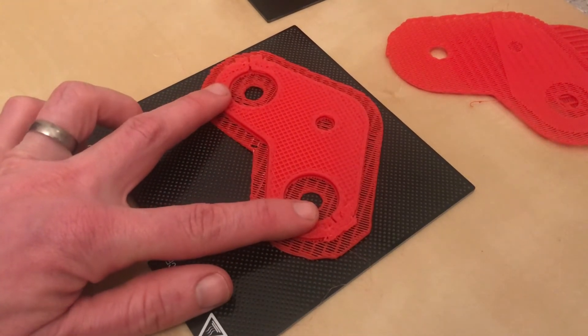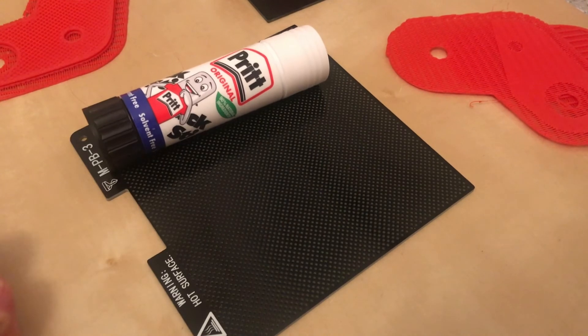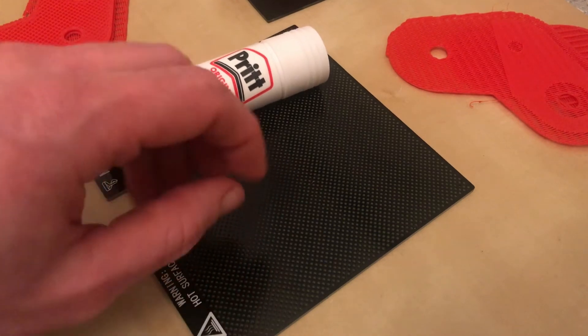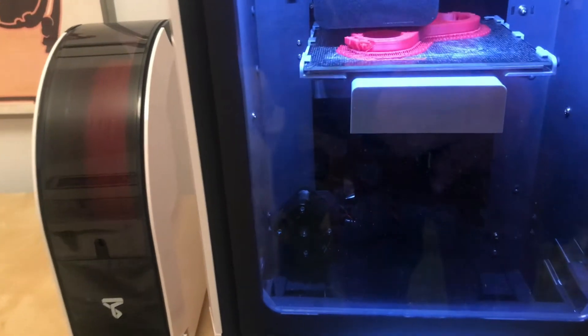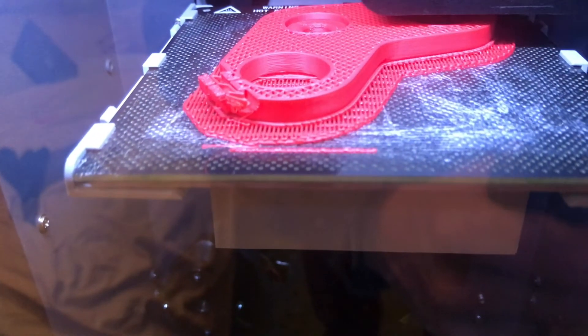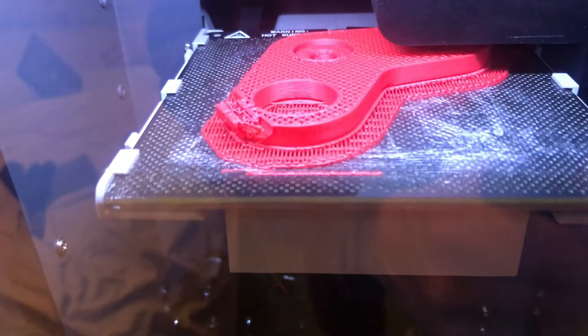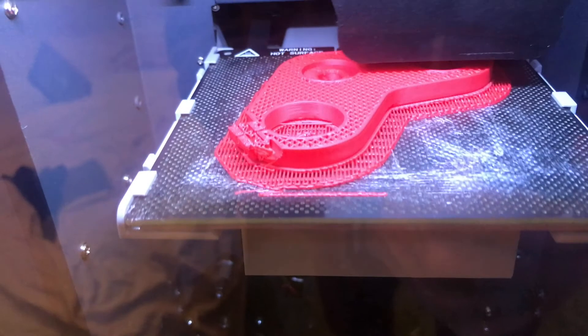The final option left was to use a combination of Pritt Stick on the perfboard, because I'm thinking the little holes in the perfboard will help the material key in and hopefully provide a little bit more grip. So this is printing the same Z-axis component but on perfboard with Pritt Stick. It's not the cleanest but it is definitely sticking — we've got much further than before. I've also printed with a big thick raft and that's virtually essential for printing with ABS.